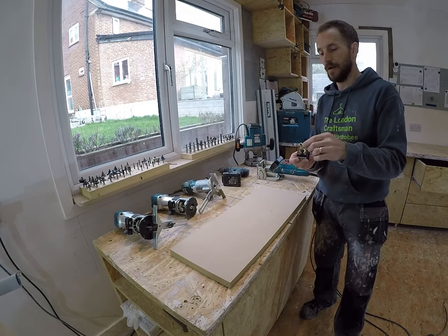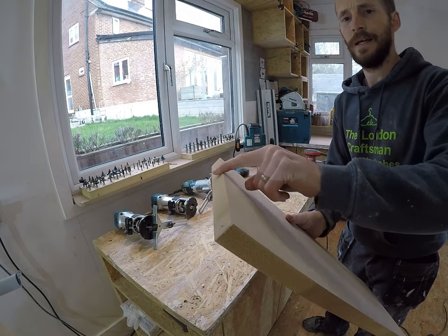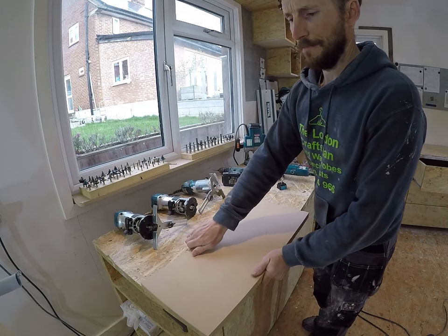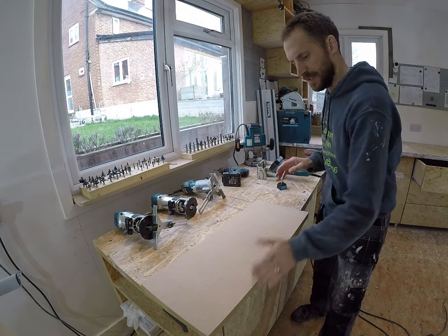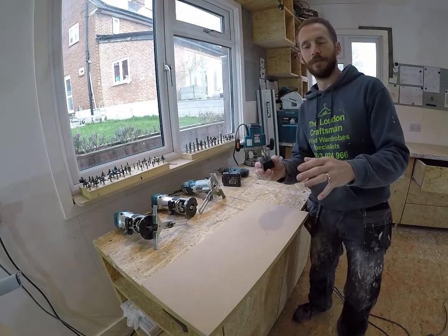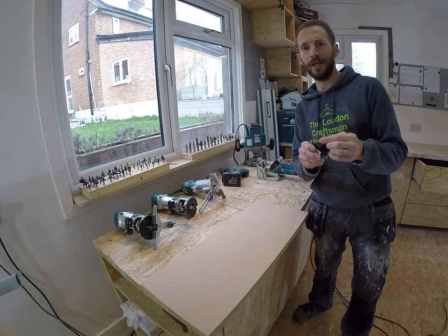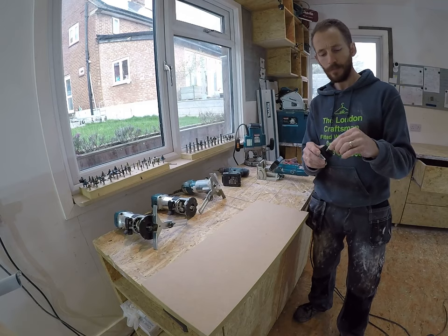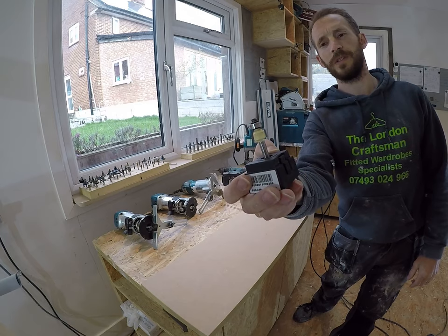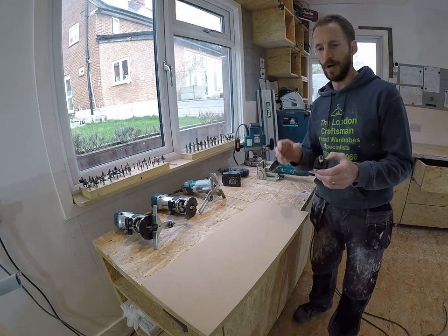What they do is give you a tiny micro round on the edge of your piece of work, and that saves you so much time sanding by hand with two different grades. I personally like a slightly bigger arris taken off — I hate just using one swipe of 240, I think it's a little bit too sharp. This gives you a standard arris taken off every single piece, the same every time. This one's been going for about three months and it's getting a little dull now, so I'll need to replace it. It runs off a little bearing, and the bearings can be replaced too — it covers two different size bearings to give you a slightly larger detail in the corner rather than just the arris taken off.